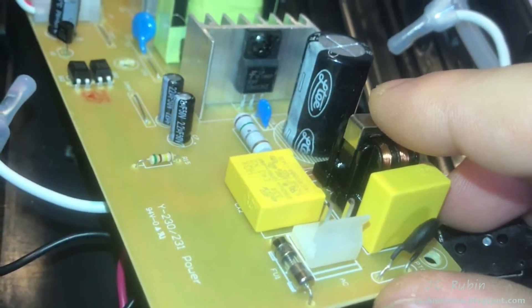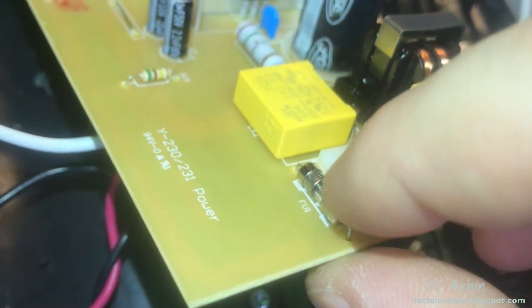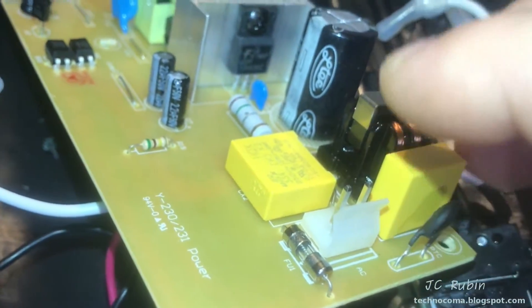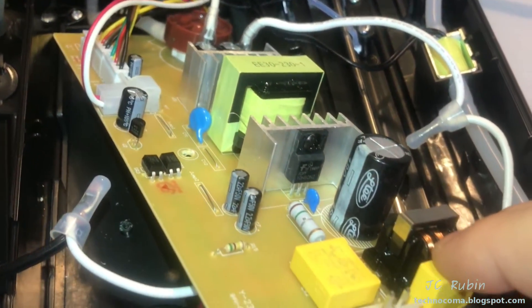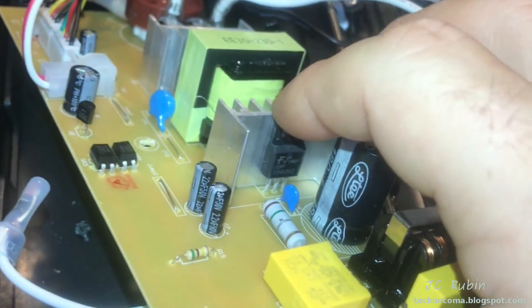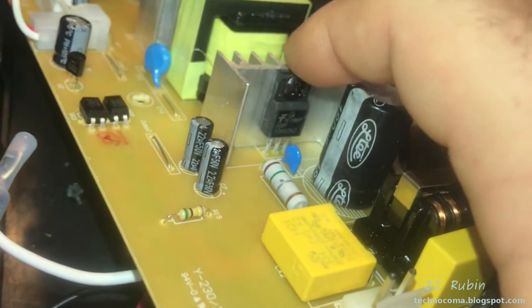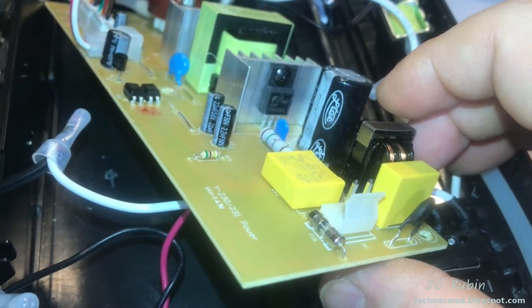All in all, the inside of these units are made with the bare minimum of quality in mind. The very fact that they put the fuse inside the unit instead of on the back of the case means any average consumer faced with a blown fuse would be forced to return it or throw it away — that speaks volumes about what this company is putting out. I hope you found this video informative, at least giving you an idea of what to look for. I troubleshot from the power switch through the fuse, through the basic power supply components, and onto the failed MOSFET. Hit that thumbs up — it helps me out a lot. Thanks for watching.